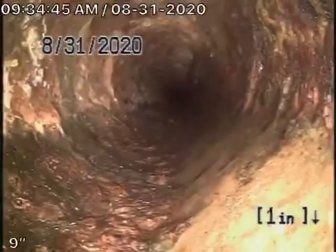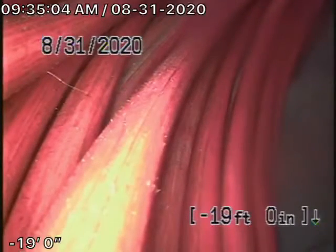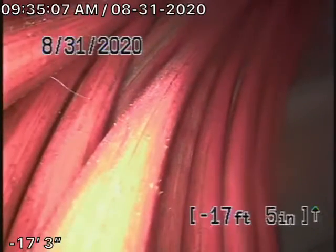This is the original pipe. Pretty much coming straight through, and then it turns. And then it comes to some ABS plastic. Oh, so it's okay, we're outside. So pretty much from the bathroom straight out is the cast iron pipe. Wouldn't be a bad idea to put an end of a line clean out over here, just in case she has a blockage or something. We're gonna stop the recording.